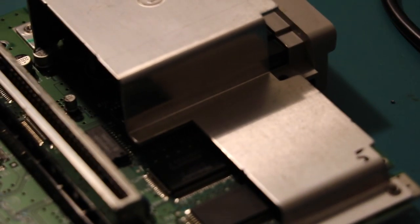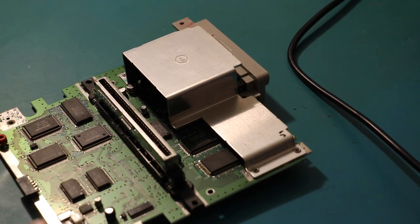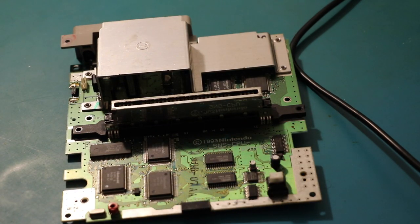Let's have a look. Yep, that's back to front. No. What? Ah, I was aligning the wrong holes. There you go. Happens to the most novice of us. So, probably best to pop one of these screws in.